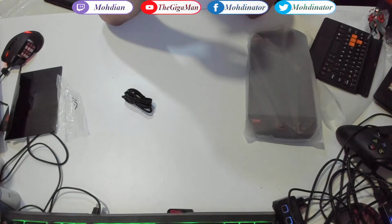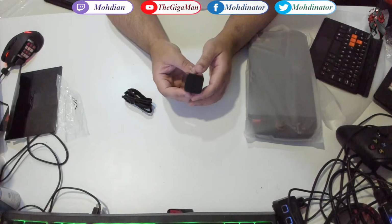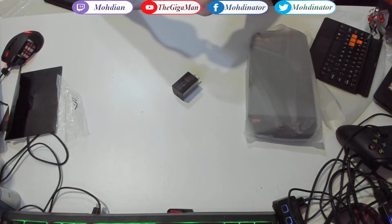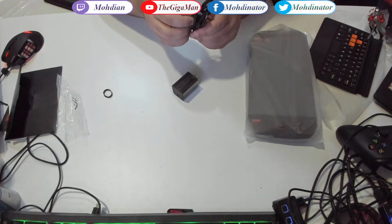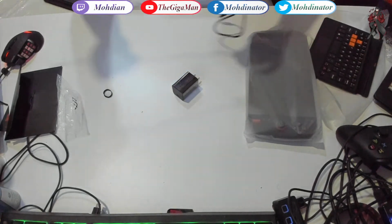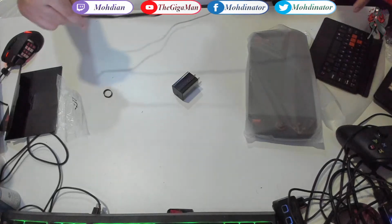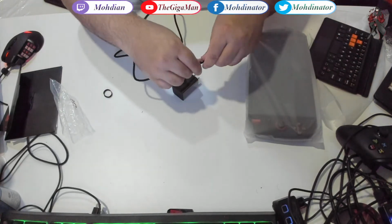So it's basically from 3.3 to 20 volts, and then 5 amps max is what they're saying. So basically, they just don't want you to connect anything to it that will draw extra power, I guess. Because USB Type-Cs are a universal standard, and some people will connect them to other devices to charge them and whatnot. They're just telling you that this is the maximum. Stick with it.